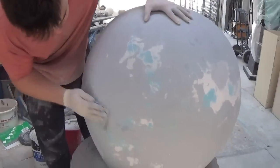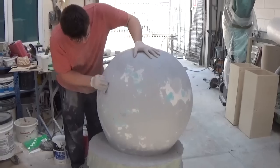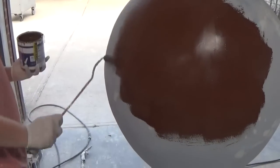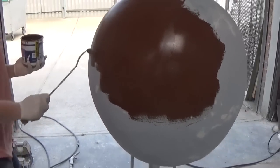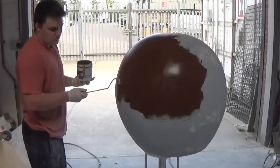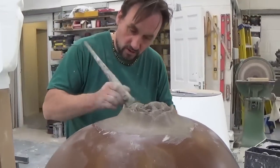As the blackcurrant doesn't need to be as shiny as the strawberry, this pattern has had a water-based plaster filler applied that could be sanded down to a relatively smooth finish. We then go over this with a solid colour to see any imperfections and to see if it's ready for moulding. At the top where the fruit would normally connect to the stem of the plant, we've created this detail using clay, and we make sure it flows into the rest of the pattern.